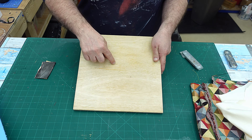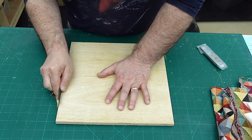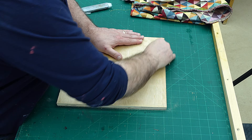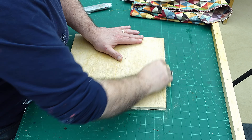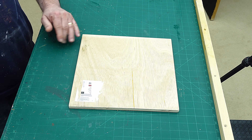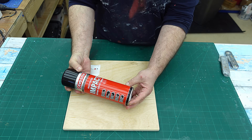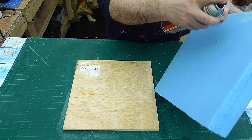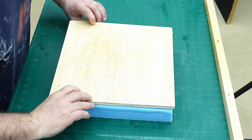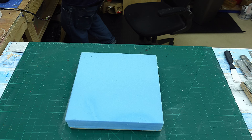Well, mum was really, really helpful. She said if I was covering this in leather I'd need to drill a couple of holes right the way through so that when you sit on it the air has somewhere to go — but I'm not, I'm covering it in cloth, so she said I should be all right. She also said to sand down any real sharp edges so it's not tempted to drag through the material, and for somebody like myself who's not really done this before, to tack my foam onto my board. So I'm going to use some instant tack — I spray it on both sides, let it dry for a few minutes, then line this up and push that down, and it should tack on there just enough to hold it — which it has, which is great news.